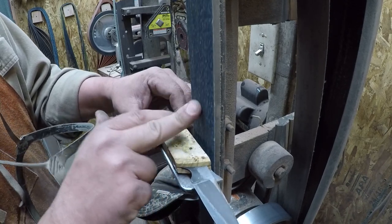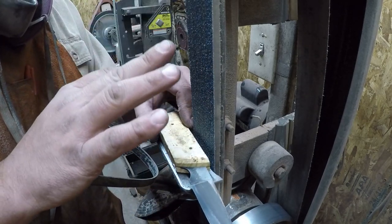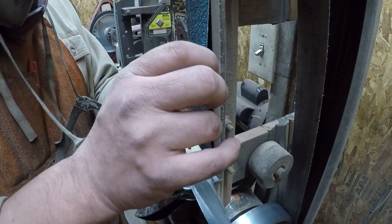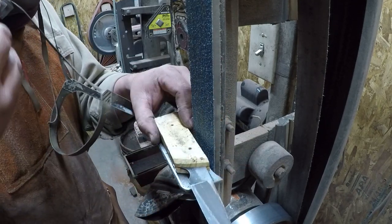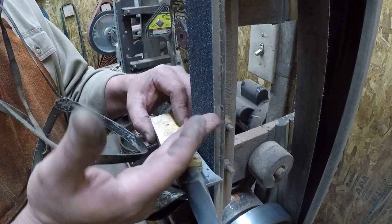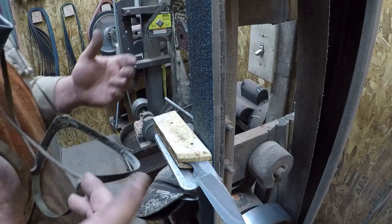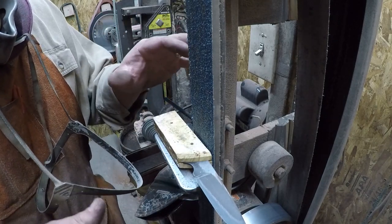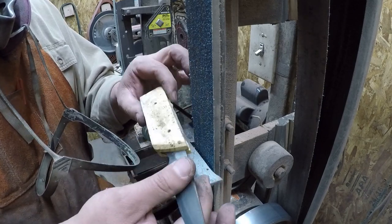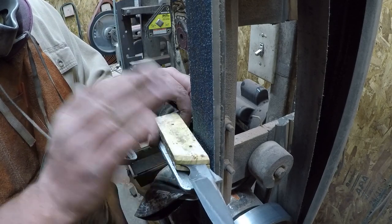also this is the AZX 36 grit belt. I get this from Pops. They're a zirconia type belt, I believe. X weight. I want to say they run like $3 a piece. They are okay on steel and everything, but I like those Blaze belts so much more for steel. But I don't want to, you know, take a $10 or a $12 belt just to grind some handle material when a $3 belt will do it just as good.